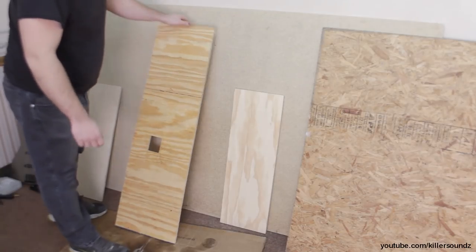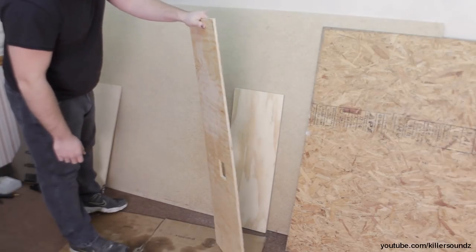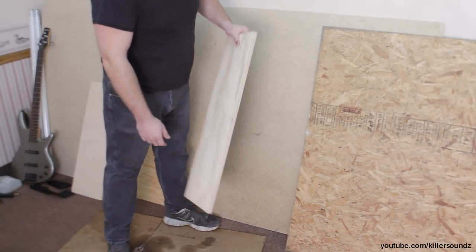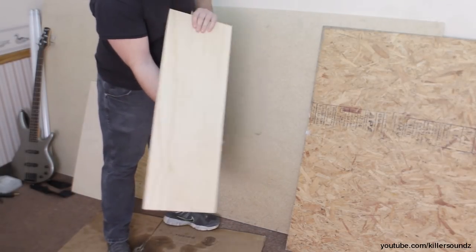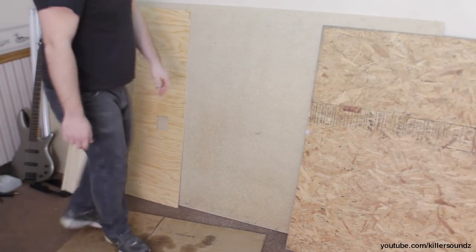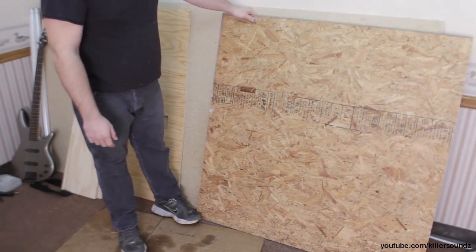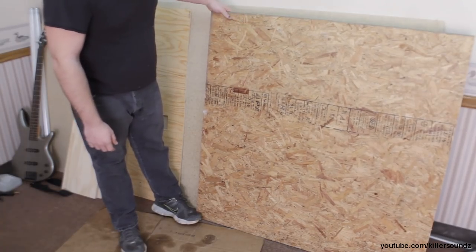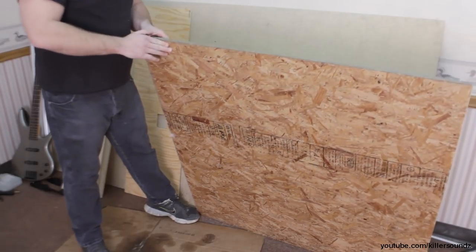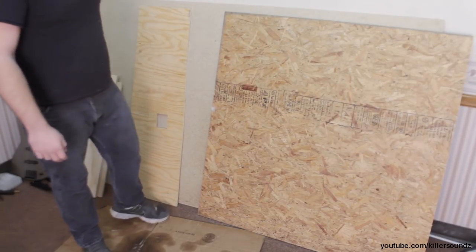We don't want that. Now this, what is this? This is like half inch sheeting. This would actually be pretty good for a shipping crate. Cheap plywood, strong. This is 3/4 pine, 7-ply. This is too nice and expensive as well. We've also got OSB, half inch OSB. This is pretty good. OSB is actually pretty dang strong. It's gone up in price recently. It used to be cheaper than particleboard, not anymore. So I'm probably going to use this for most of the shipping crate. I might cut a couple pieces off of this for it. Either way, I've got it sitting around here.